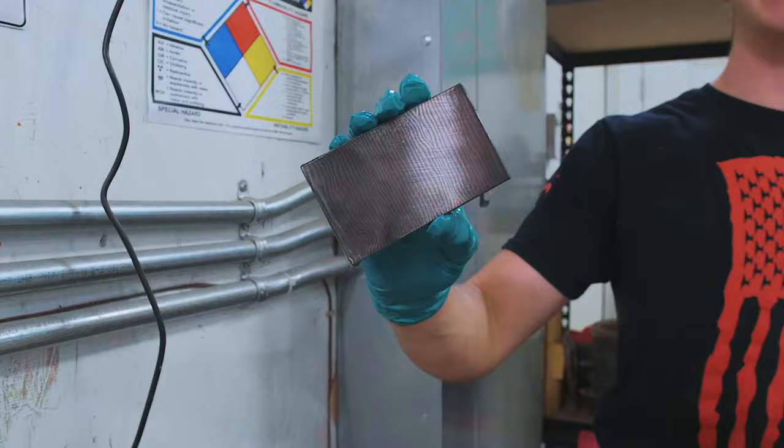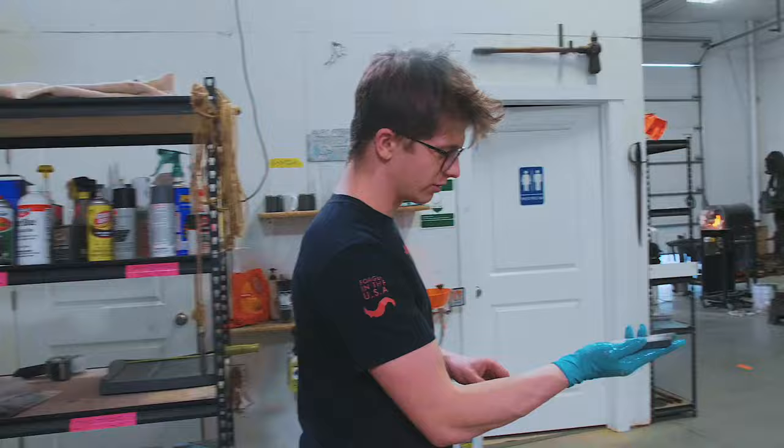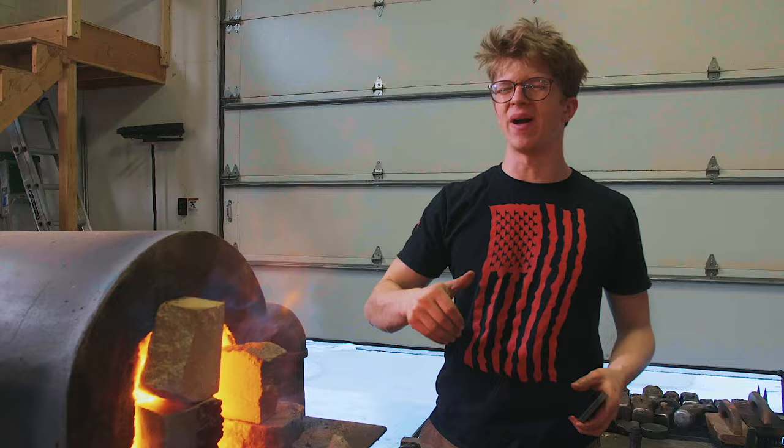Oh yes, I think that just does the trick quite nicely. Very simple, so nice with the lines going across it — it's exactly what we're after. This now gets to go back in the forge, so all that fine finishing work I did on the grinder is for naught. Not exactly true — I did the fine finishing work even though it's about to get oxidized, because I only need to heat it up for one heat. By having it ground nicely, when we're done stamping our mark in it, it's going to take a whole lot less grinding to get back to clean material. I'm going to have the forge be very fuel rich — that means we're going to put a lot of fuel in so that the metal oxidizes less. You see as that dragon's breath comes out, that means we're pushing more and more propane in. As the dragon's breath is shorter, it's a much more oxidizing flame.